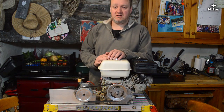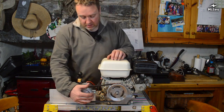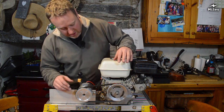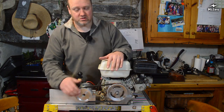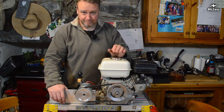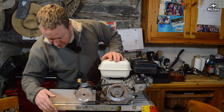One thing I'd like to point out by way of a disclaimer is an obvious safety feature that's missing on this generator. You can see the exposed belt here — that's pretty hazardous. If you put your finger in that when it's running, it's obviously spinning very fast. What you would do with something like this is put some kind of cover over it. I haven't put one on because I want to show you it running — it wouldn't be so obvious how it all worked with a cage over it.